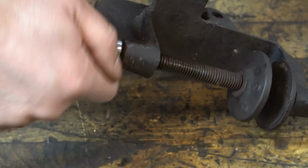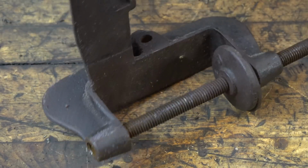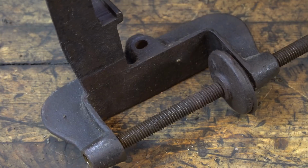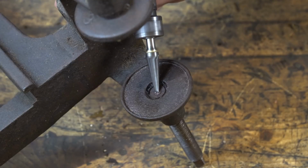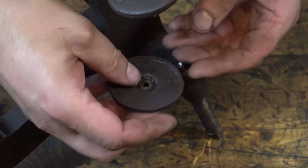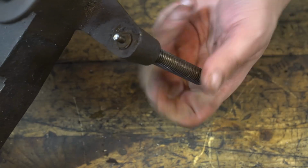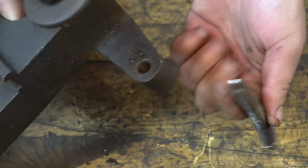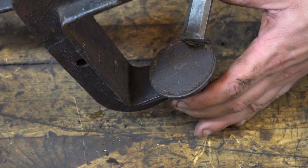So these clamps here that screw down onto the actual door to hold the mortising machine in place, I thought would come out if I unscrewed it to its maximum potential, but apparently that's not how it was designed, unfortunately. So I literally have to grind away the peened over end of the threaded rod and snap off the flat portion, which seemed to have pieces of fabric or leather in them, so that I guess they wouldn't scratch up the door when you would clamp it down.